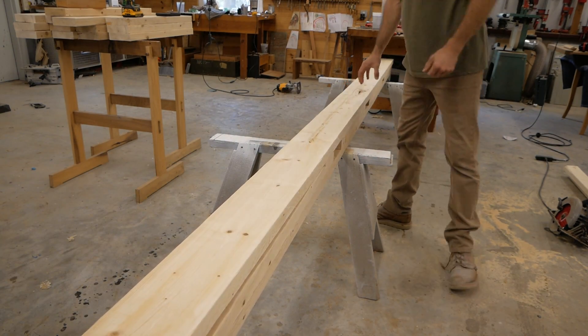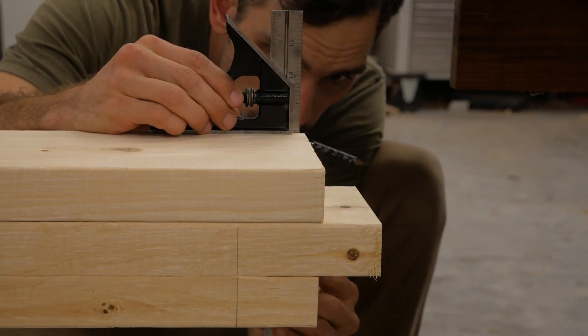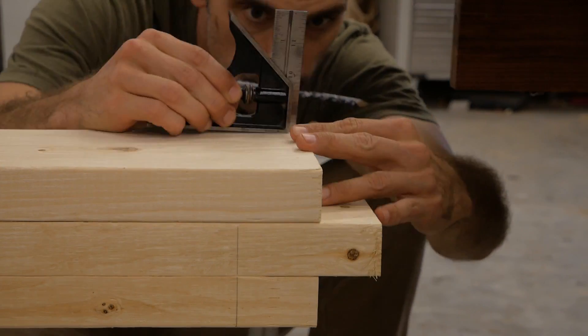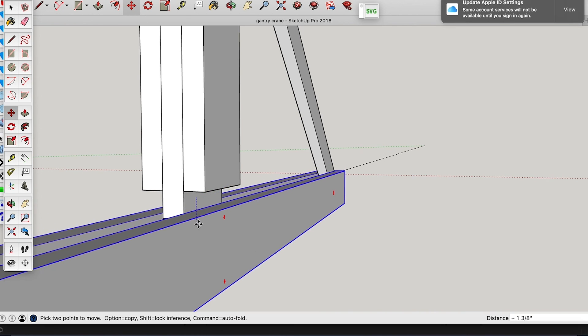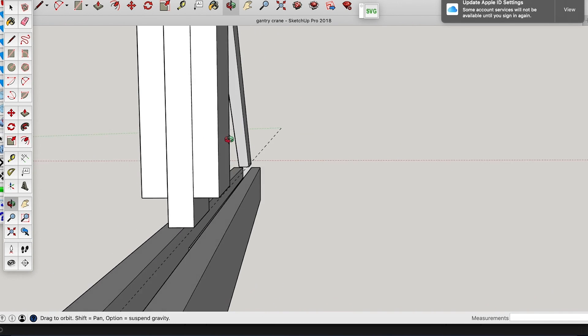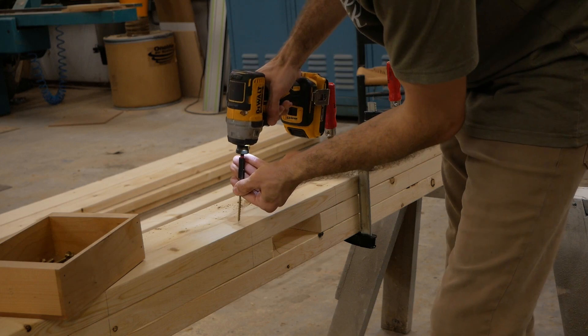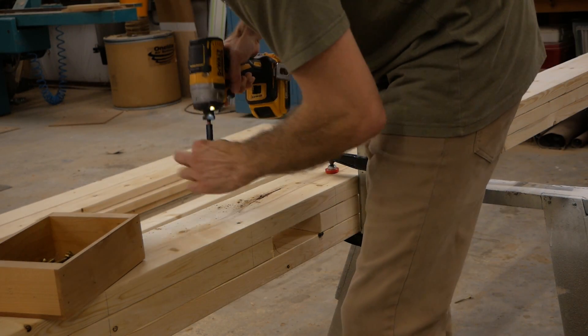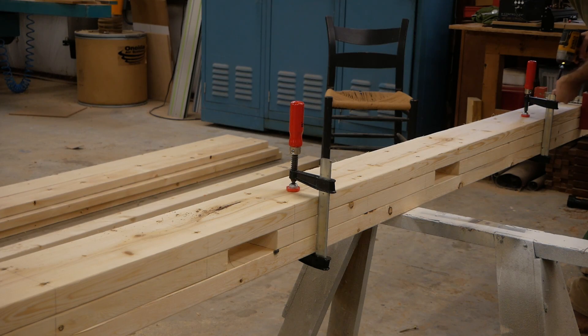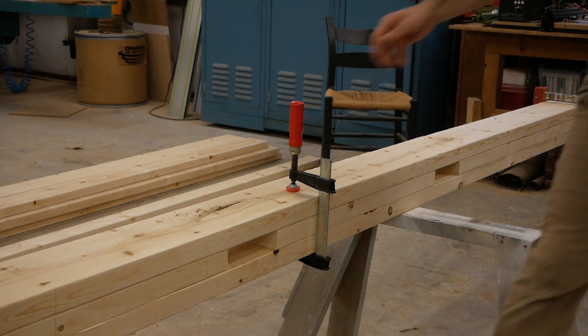I'm leaving the middle piece long — it's kind of like a little tenon that will drop into those feet. That's why I use that two-by-four in the middle: it gives me a point to drop it into, and then I'll put two bolts through that. My idea was that if I don't use these ever again, I could take them apart and at least use the lumber. So I didn't want to nail anything, because that's just a pain taking nails out.